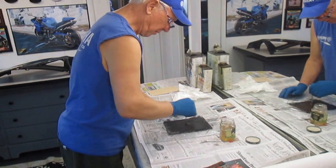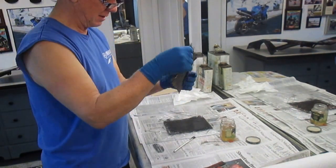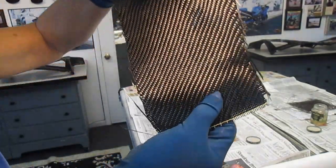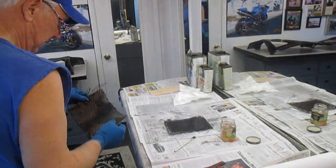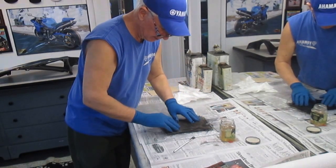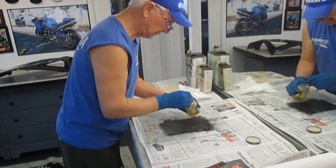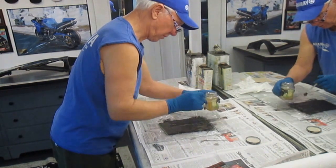You can tell if it's getting hot — just grab the jar, and if it's heating up, put it outside. Now, I also want a cosmetic piece. You never want just one layer — I want two pieces because there are little pinholes in the cloth, and if you look through them over a part that's not black, you'll see the pinholes. This second layer will be the final cosmetic part, and this will really be step one of making the plate bracket.